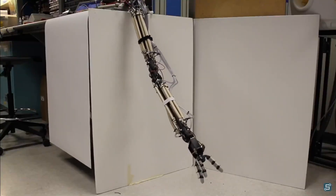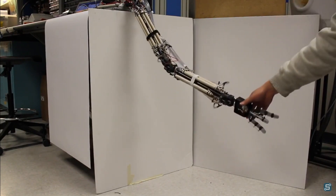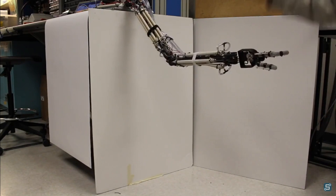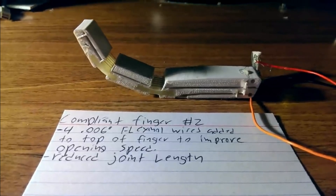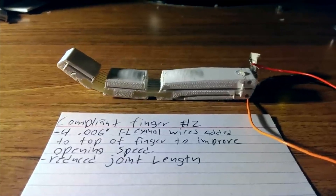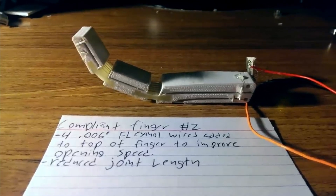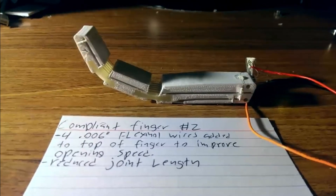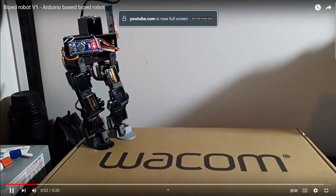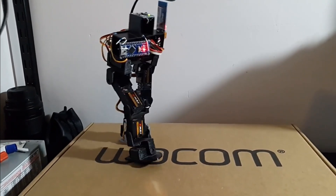There are various other types of muscle-like actuators used in robotics: pneumatic, nitinol wire, and electric. Pneumatics are robust but require a pump — here's a pneumatic arm from the CNU soft robotics and bionics lab. Nitinol muscle wires contract with heat and expand with coolant — here's Carter Hurd's muscle wire finger. They aren't widely used in applications; I tried them as a kid for a hexapod robot but they moved disappointingly slowly and I accidentally burnt one out. Electric actuators include motors like servos and small actuators, or larger ones with planetary or cycloidal gearboxes.